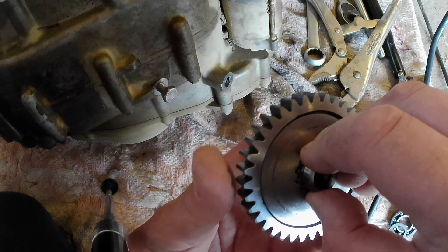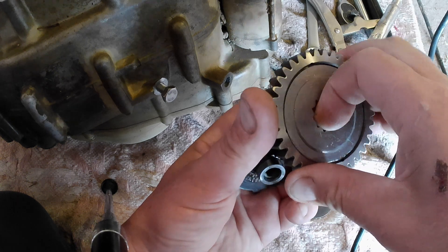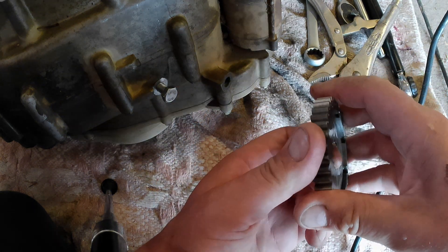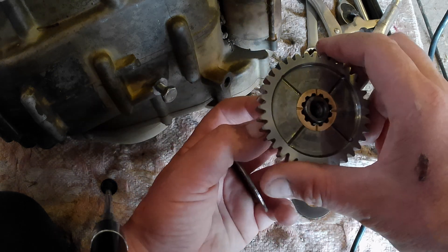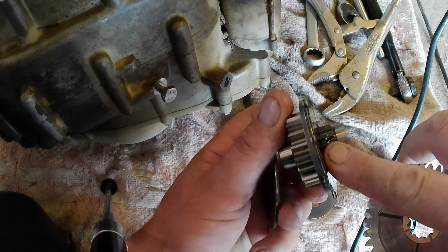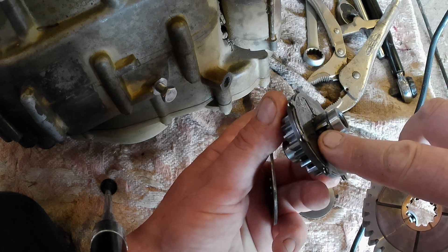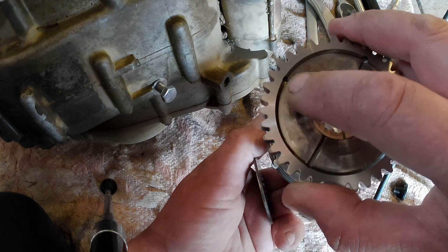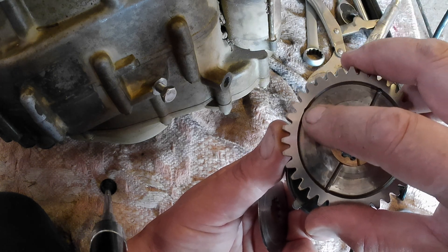The oil runs up the other end of this torque limiter. Because this is spinning, you've got centrifugal force acting on the oil, which enables it to go into the passageways inside. If I take this disc off — it's not easy because it's stuck together with oil — what we end up with is oil inside this shaft here, and just there you can see a hole. So the oil, under centrifugal action — this thing's spinning pretty rapidly — oil will be thrown out of there, forced into these grooves and oil ways inside here. When that disc is in place there is actually a gap right at the very edge to allow the oil to come out so it doesn't get trapped.